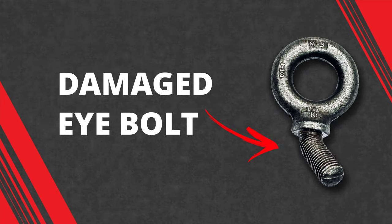We'll describe their pros and cons and clarify the common uses for each. Used as a lifting or securement point during a lift, eye bolts and hoist rings are sometimes the most common types of rigging hardware. Although they are used for similar applications, they differ greatly when it comes to design, capabilities, and features. It's not uncommon to see an eye bolt bent or cracked during a lift when a hoist ring could have been used to better accommodate the rigging and support the load.